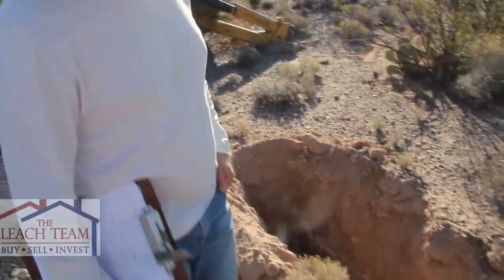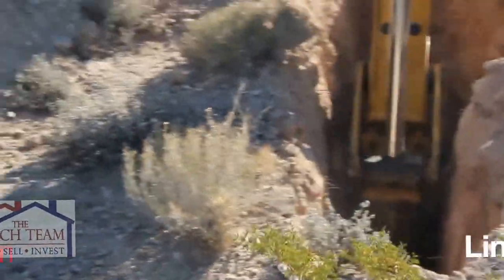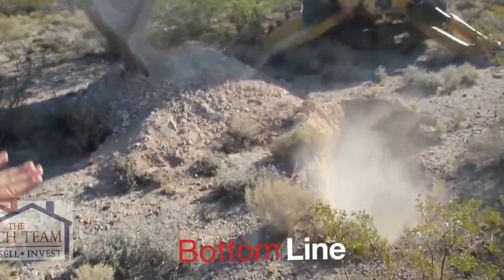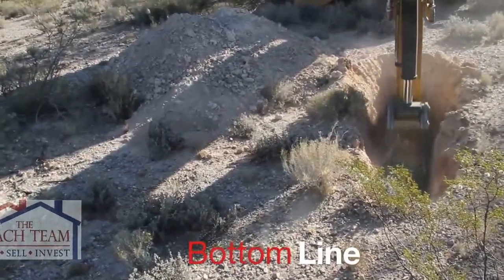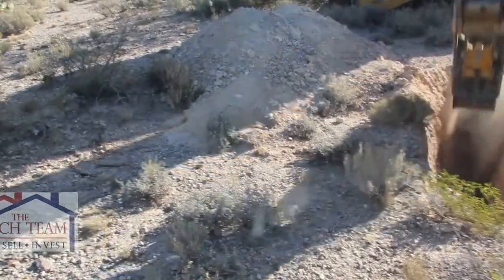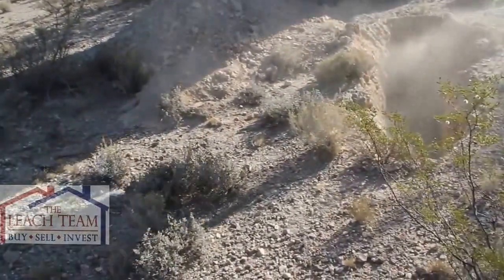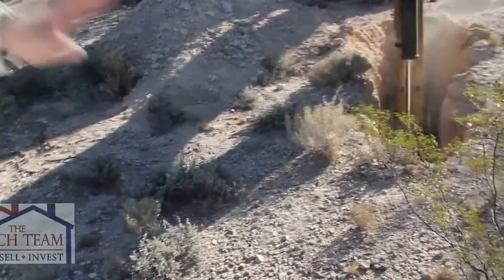So, you want to keep going? Okay. Right in there, a little white, looks like talcum streak through there. Yeah, that's a little buildup deposit of minerals. So you'd want to put your leach field away from that? Beneath it. Oh, beneath it, okay. If we dug and found just massive layers of that, then we're probably not in a good spot. You could have a problem if you don't get through it. Usually in Tucson, you hit caliche at 2 to 3 feet, and you usually can get through it.